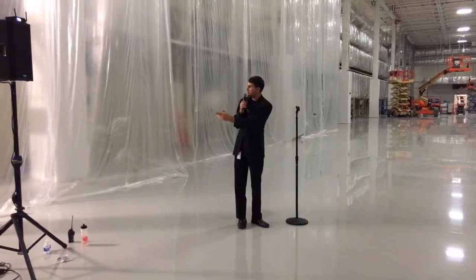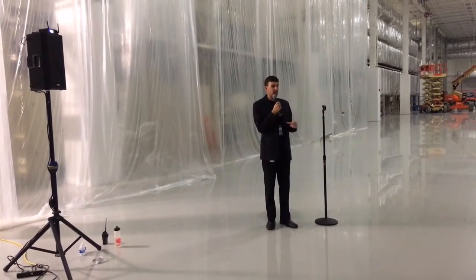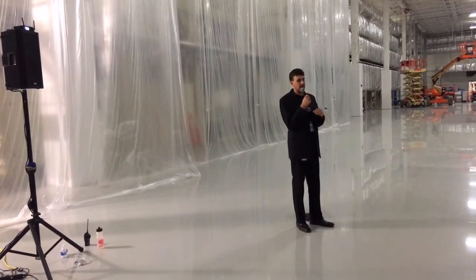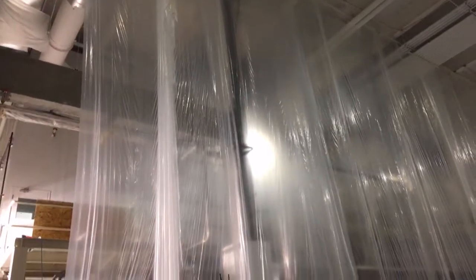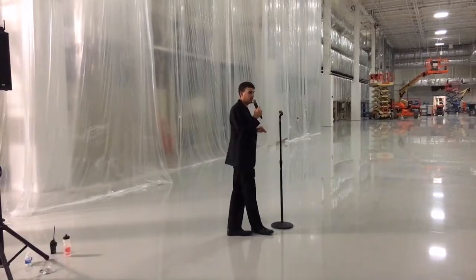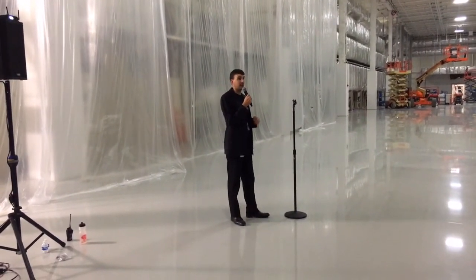That metal travels along the length of the oven, each chamber having a specific airflow rate in and out and controlled to a specific temperature to evaporate the solvent. By the time we're at this end of the oven, the solvent's all gone, and we're left with a thin metal foil with solid active battery material attached to it. We then flip it so the bottom becomes the top, coat the other side, and end up with a fully coated foil with two active layers on either side.